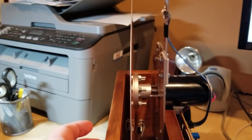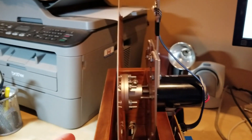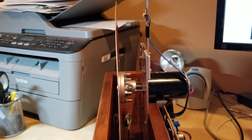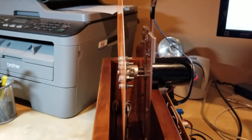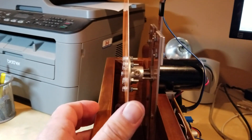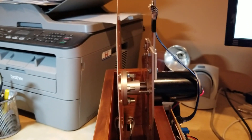You can see that the disc isn't quite as flat as it should be — it's got a bit of a warp in it, which I guess was a result of the water-cutting process. It may also be because this disc is thinner than the first one, only about 30 thou thick, whereas the first one was about 40 thou thick. But I run it at about 1500 RPM to sync with the camera, and at that speed it kind of flattens out.